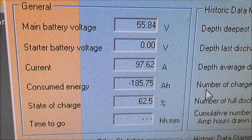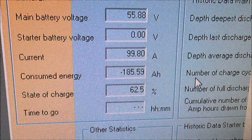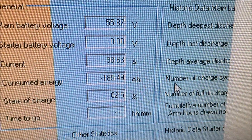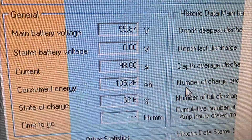She's dropped back a little bit now, but you all saw her at 100 amps going on 18650 cells. I reckon that's probably not going to be a perfect situation for the batteries so I'm not going to leave it like that for too long, but I'm going to run down there and see how hot and how loud that inverter is getting.